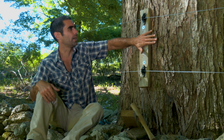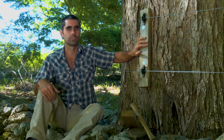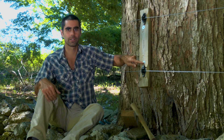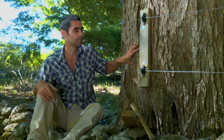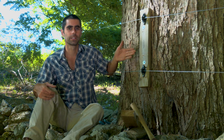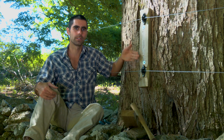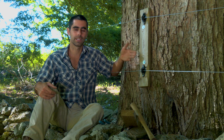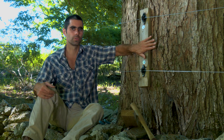That's one way of attaching a fence to a living tree while doing minimal damage to the tree. It's got one hole from a nail on each side — both holes together are smaller than one maple syrup tap. Those nails won't stay in the tree because they get pushed out as the pressure-treated board gets pushed out. If you don't like pressure-treated, you could use a black locust board, white cedar, or red cedar boards — anything that's rot-resistant will work. Choose what works for your farm.